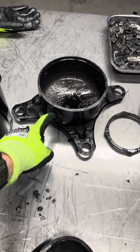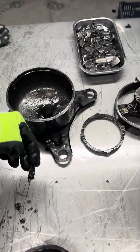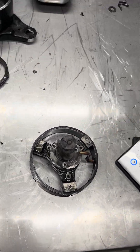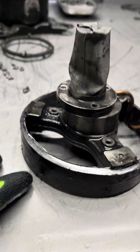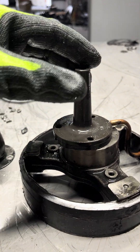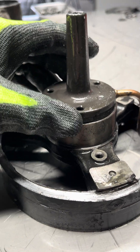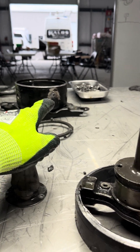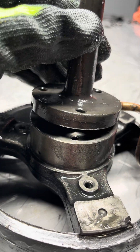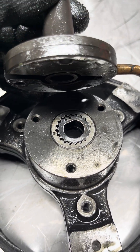You've got one connection here which is a crankcase heater for oil within the base — it sticks out here with two little pin connectors on the side. Then the other one is actually an oil port that's designed to connect at the base of the compressor. This is the base oil system of an LG VRF compressor. You've got this nice metal screen that's designed to filter out any contaminants and keep it from getting clogged. You've also got this nice little cone hat — that's the connection for the oil port on the side. This compressor has two oil connections: one at the base and one right above it. There's a chamber, and we use what is considered a gear drive for that oil return on the VRF compressor.